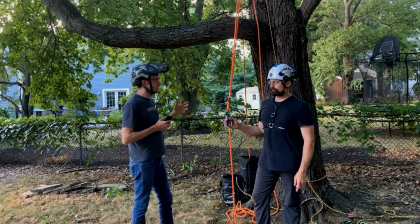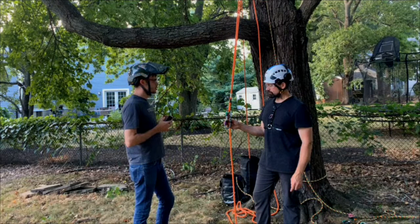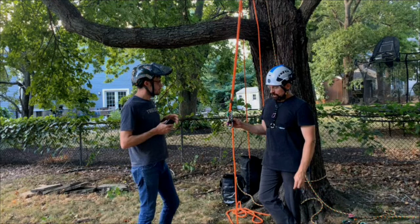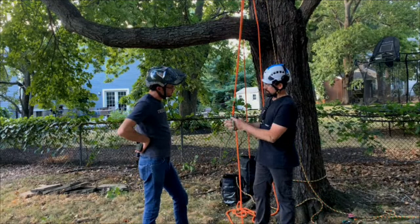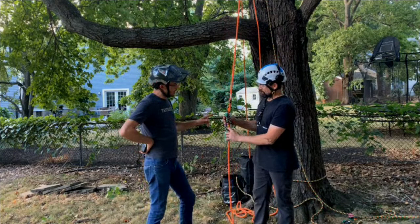When I entered the tree industry, it was stronger is better. A rope with 200 pounds more MBS sold better than a rope with less MBS. I think we're getting away from that now. We're looking more towards function and weight, and is being at 6,000 pounds versus 5,000 pounds better, right? I don't know. I'm not quite sure if in an oval carabiner it's 50% spine and gate. I would assume that the spine is still doing most of the work. Just to clarify that. Oh, I don't know about that. I think that's why we moved from oval to D-shaped.